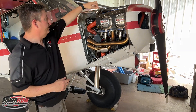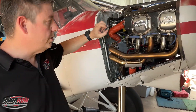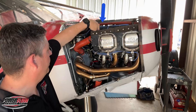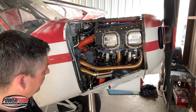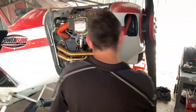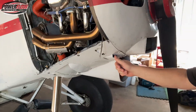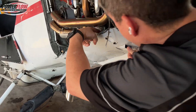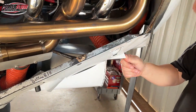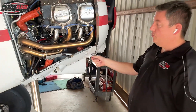Taking you through it, this has the option for two different cold air sources — one of them being the front right baffle or the rear right baffle over here. The aircraft's original baffle — I'm going to pivot so you can come in here — the original cold air source is right here. As you can see, we made the choice to put scat tubing in there and it's routing all the way around, entering the back left side of the shroud.